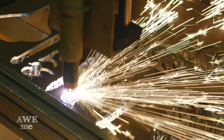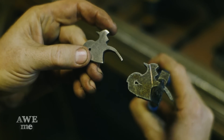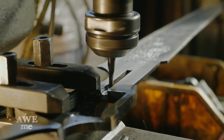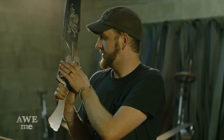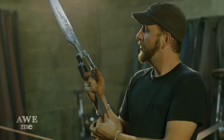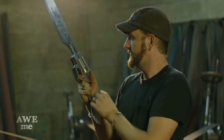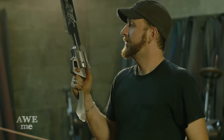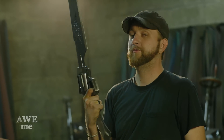After measuring off a preliminary set, I recut the trigger and the hammer so they'll fit the gun blade. Using the Gorton milling machine and a ball end cutter, I relieve the frame for the cylinder pin. We've got Squall's gun blade almost all done. All we have to do is attach the wood slabs for the handle, get this outer piece TIG'd on, attach the trigger and hammer that Carrie has machined out, polish her up, and we're ready to battle.